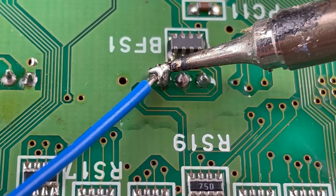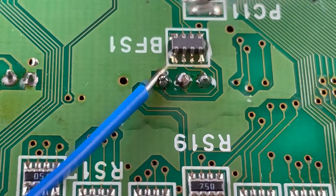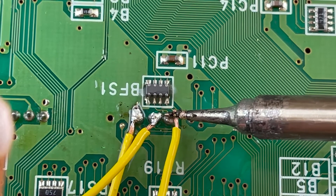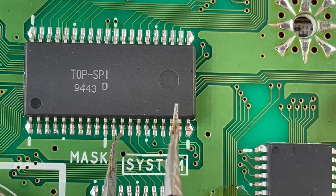I'm applying some flux and some leaded solder because these were soldered a long time ago, just to get things flowing — and yes, I do need to clean my iron. The wire I tried to use first was a little thick and it was just taking so long for the heat to transfer I couldn't get it to connect. So I ended up using the supplied wire which was much narrower and softer and heated up much faster. Although it's a little messy, it is a much better connection.